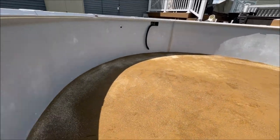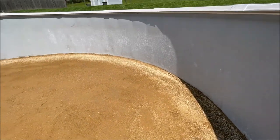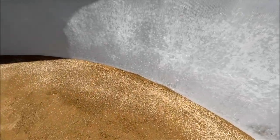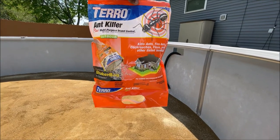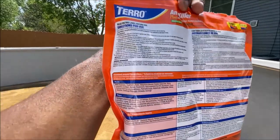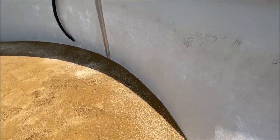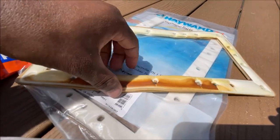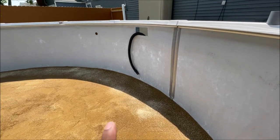So we got the cove rebuilt around the edges. It's enough that the track isn't showing, plus a couple of inches — so that should be plenty. I put down some granular ant killer. This will help keep any carpenter ants or any type of ant from trying to get up inside of the pool. They usually come in under the pool wall, not so much in the center. I had to get another gasket — I took it off the skimmer and the bottom half was kind of cracked up a little bit. So we got a replacement gasket on that. That doesn't need to go in until after we get the liner in and start getting some water in.